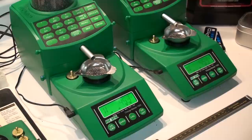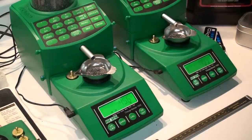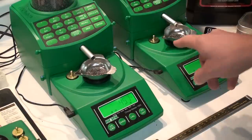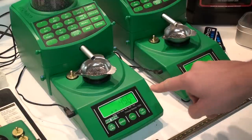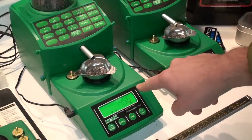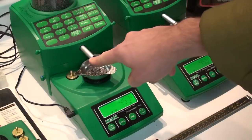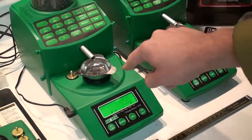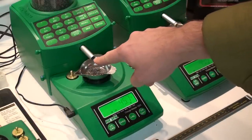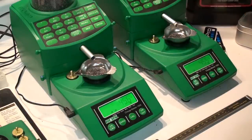The Chargemaster on the left is catching up, but mainly because it's dumping grains. In this instance they hit about the same time. The Chargemaster on the right verified the weight quicker, but now you can see that we're over on the one on the left because powder falls out after it's done trickling — it's got a big clump of powder right at the end of the tube. That's one of the things the straw mod helps solve. It takes out the threads at the end and smooths them out so the powder can fall out in a more consistent manner.